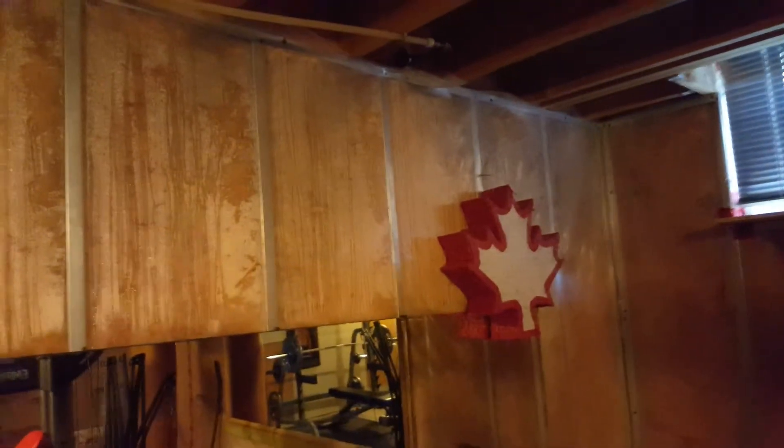And then you're gonna get mold behind your walls. Look at this — you see what I'm talking about? We've got major condensation. You see that behind the vapor barrier? Now this is my basement — this is my gym actually. I've been in this house for about seven years and as you can see we've got steel stud exterior walls, vapor barrier, and regular fiberglass batt insulation.